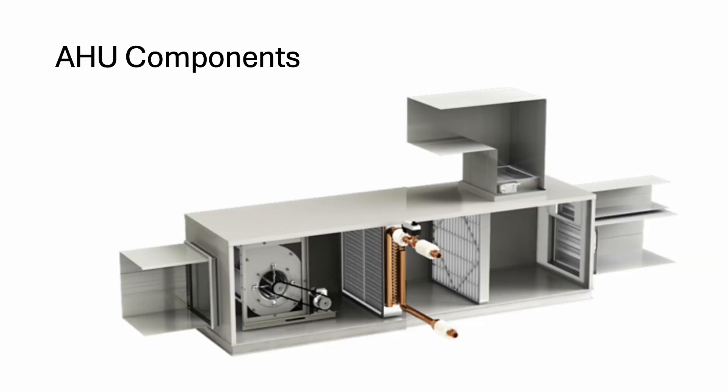So let's talk about what's inside an AHU. Typically we have a very simple AHU — AHU is highly customizable but there are always these few components. If you look at this section cut, here will be the return. It can be one return, two, or three returns depending on the design. Then there will be fresh air — the fresh air can be from the side or from the top, whatever the duct layout requires.